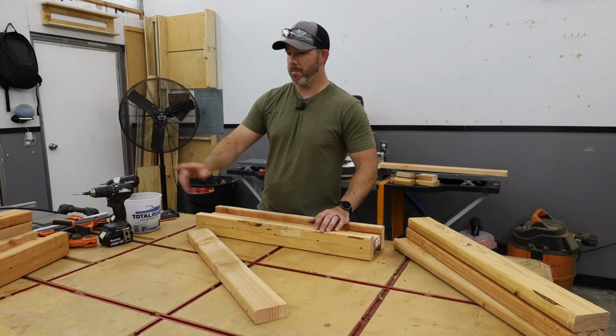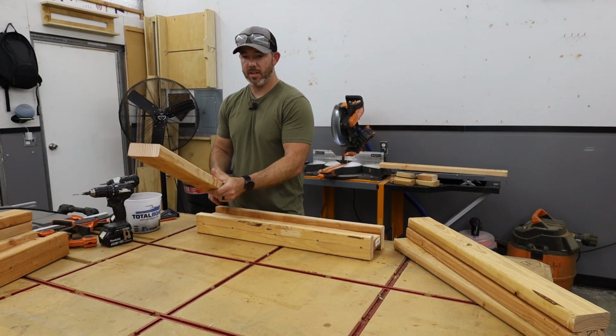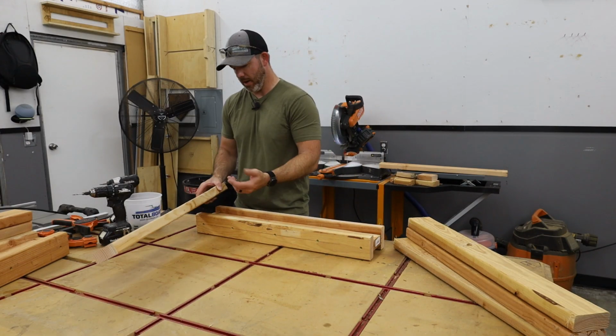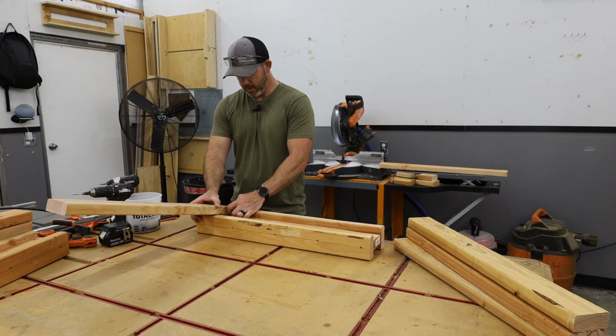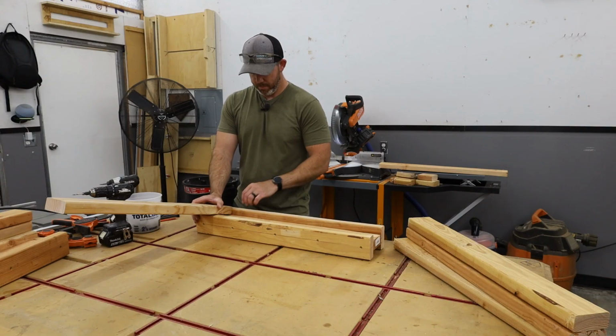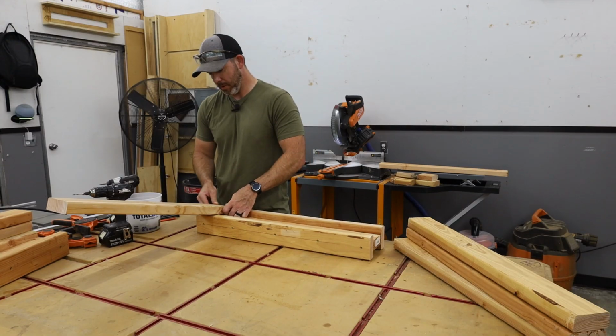All right, so I got both I-beams put together, did the other one off camera, but now it's time to attach the legs. I'm gonna make sure that my bad ends of the legs are at the feet that go on the ground, just so I don't split it even further while trying to screw it in. But basically they just sit in here like this, inside, under the top lip, and then definitely pre-drill these ones because they probably will split.